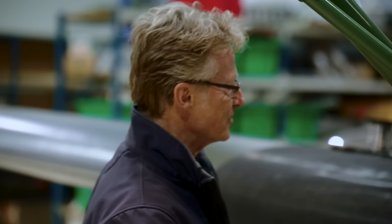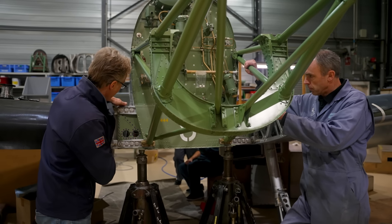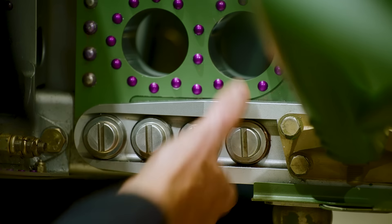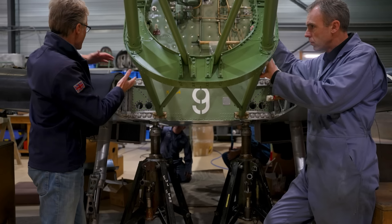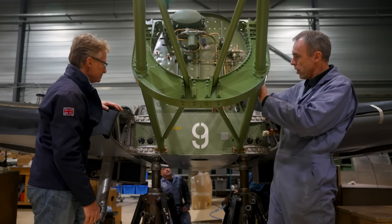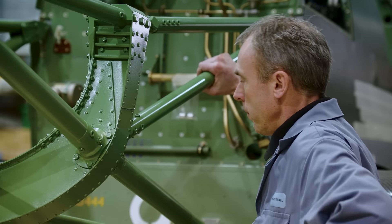I love it when it's exposed like this because you can see the seven bolts — three and four — that hold the wings on. We saw these being built at Airframe Assemblies when she was first taking shape a year and a half ago. The top wing spar and bottom wing spar bolted to frame five, back of the engine — that really is the structural heart, the strength of the Spitfire. It always amazes me that you can get such strength and hold the weight of the wings pulling seven G. This area and the first two feet of the wing house where the engine bolts, the undercarriage bolts, and the wings bolt on — tremendous loads.